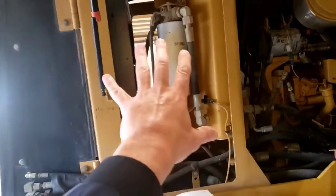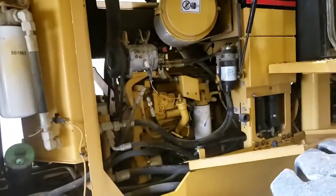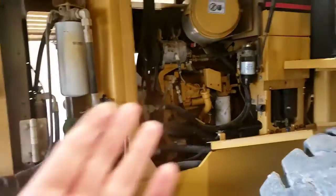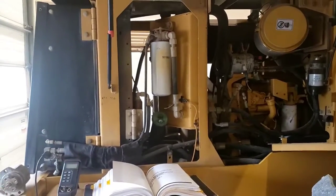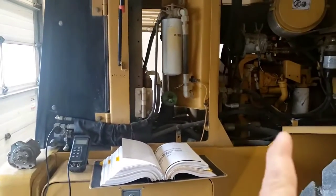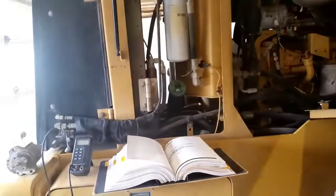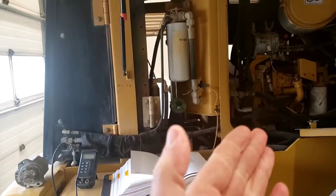On a modern wheel loader, the fan is sealed in one box, as it is on the grader as well. We've got our hydraulic tank and cooling package where airflow moves out the side vents, and the engine is basically somewhat sealed from that airflow. Later versions of a wheel loader like this may have a reversing fan option or a variable pump where they change the fan speed with a swash plate in an axial piston pump, but this one is not that sophisticated - just fixed displacement pump, fixed displacement motor, with engine RPM determining pump flow and motor speed.